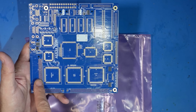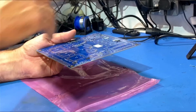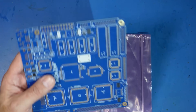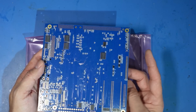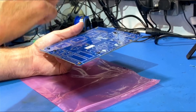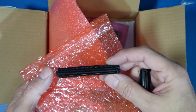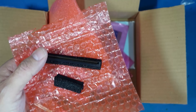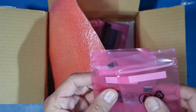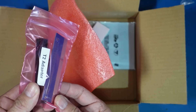I was going to build this on the heat plate, but I realized it comes with quite a few little SMD surface components already done, and underneath there's a load of SMD too, so I can't use the heat plate. It's going to be a matter of tinning up the pads and heating with a heat gun, then placing the chips on the board. Back to the box: we have a pin header, and this one here is for Amiga accelerators, RTG cards, whatever you want to add. There are some pre-programmed chips here, an adapter card and socket.